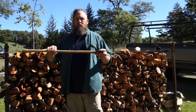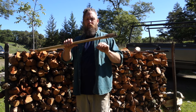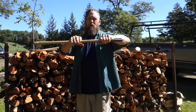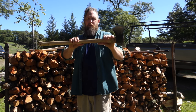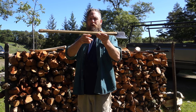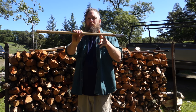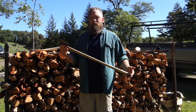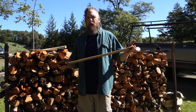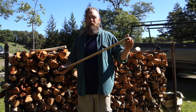Here she is — things are working pretty good. It's been staying straight. I did have to re-straighten one section right here — it was just a small bend in one area. What I did is I put that over a pot of water, put tin foil on top, and steamed it for maybe 20 minutes, just enough to get it hot all the way through. Then I put a wooden block here, a wooden block here, and clamped it to the table so I could really isolate and bend just that little section between the blocks. I've been using this quite a bit and it's been staying straight — that's a good sign, because when it's under use it's under stress and the handle gets bent. So if I'm bending the handle and it's springing back to where I straightened it to, that's what I want.